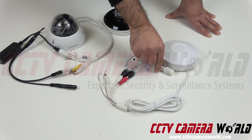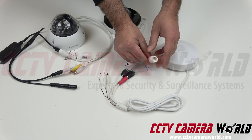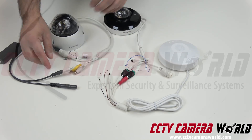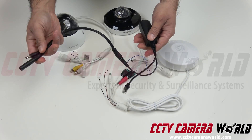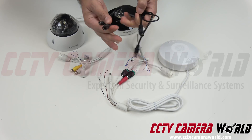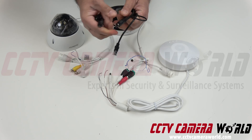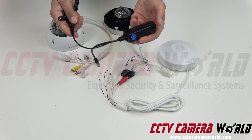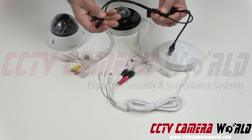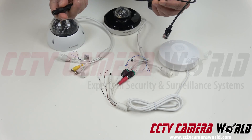Now what's left? Data. If I connected my ethernet cable coming from the PoE source, I won't be able to take power and plug it in here. So here's what we do — you still need these three things: the PoE power splitter, the DC power splitter, and the DC power coupler. What I'm going to do is take my PoE power, split it into data and power, and then split the power again and couple it to connect it into the speaker.